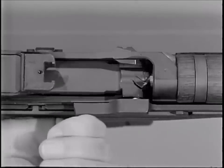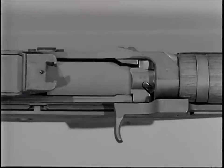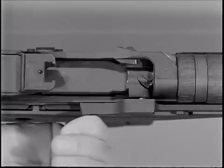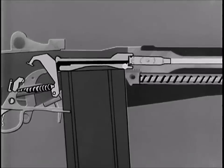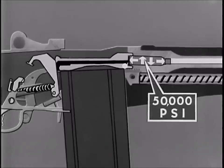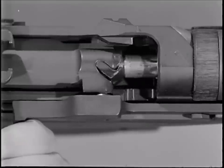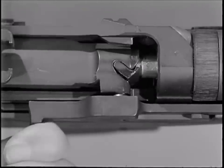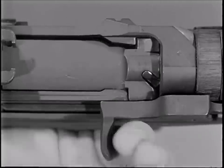While the bolt is being unlocked, slow initial extraction takes place. The rim of the cartridge case is gripped firmly by the extractor, and a slow twisting pull — called slow initial extraction — is imparted by the rotating bolt. At the moment the cartridge was fired, gas pressure of 50,000 pounds per square inch expanded the brass cartridge case tight against the chamber walls and forced the head of the cartridge case against the face of the bolt. To pry the cartridge loose, the slow twisting pull is required. The corresponding radii of the locking lugs and the locking recesses, along with the rotation of the bolt, allow a slight rearward movement that loosens the case in the chamber and causes slow initial extraction.